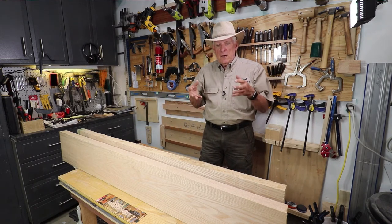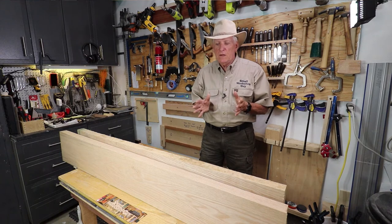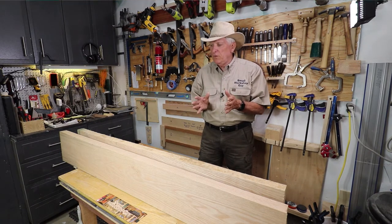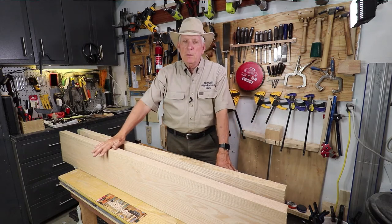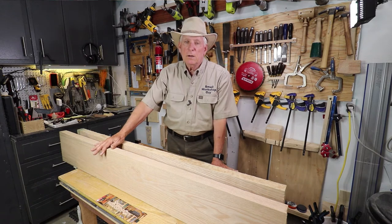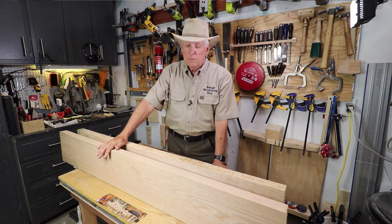...1,728 square inches. To convert that back to board feet I divide by 144, and it turns out that's exactly 12 board feet. But I didn't pay the store for just 12 board feet, because they have a premium they charge for giving me a straight edge — to do that they may have had to cut off some excess. So they charge me 12% extra.